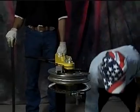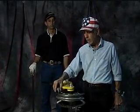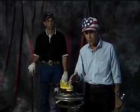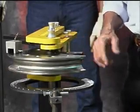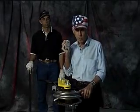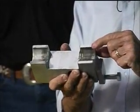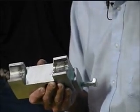We're going to explain the backing blocks and die setups. Any die is available in three configurations: a 120 wrap-around, a 180 wrap-around which is a half circle, and a 240 wrap-around, which is the die you see right here. If you want to complete a 180-degree bend, you need a 240 die. The backing blocks are machined so that one side is perfectly straight and the other is machined with a curvature to fit the tube and die you are bending.